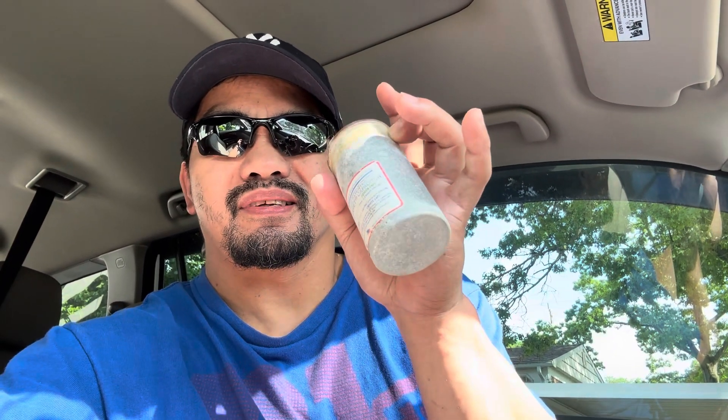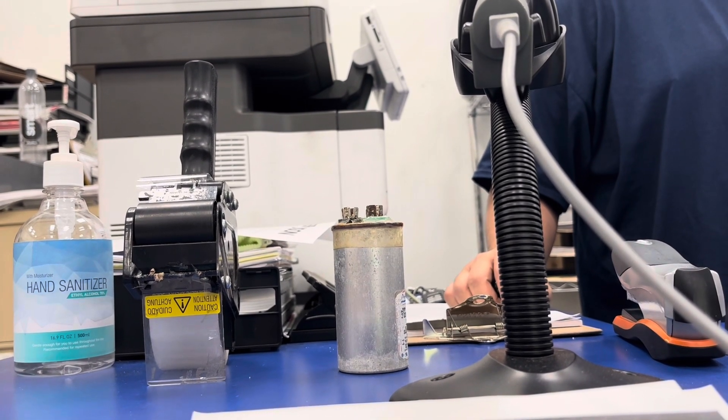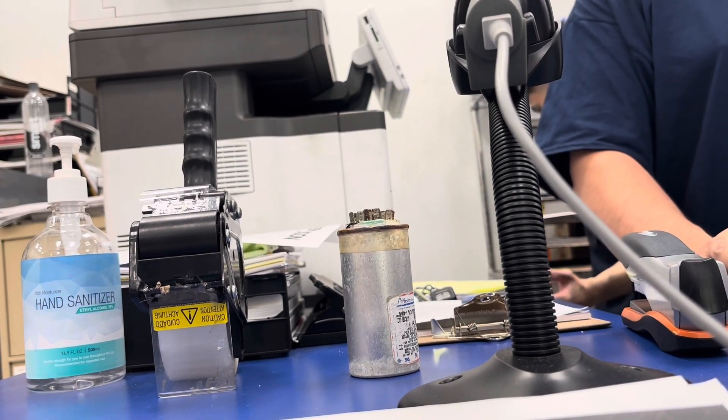Hey, it's early summer and our AC is broken. We'll try to fix it right now. One of the damages on my AC is the capacitor, so we'll go buy one at the store and try to replace it today. I'll show you how to replace it if you guys have the same problem. I don't have a round one, I have an oval, but it's the same thing — same exact microfarad, same specs, just a different shape. Should work fine.